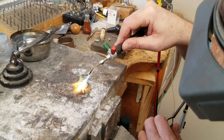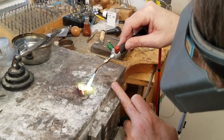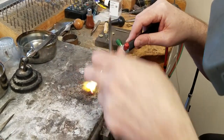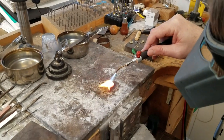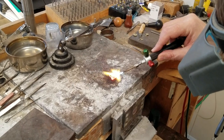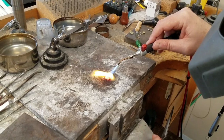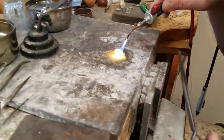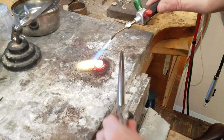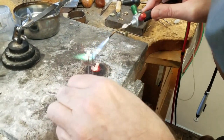You don't want the blue tip of the flame to be right on the metal — you want it just back from there. The reason is that this is the reducing area of the flame and it's not putting too much oxygen into the metal. So what we want to do is just heat this until it balls up — you might have to push it around a little bit — and then with your off hand, gently shape it while it's balled up.